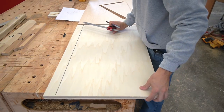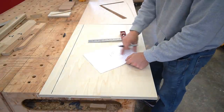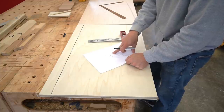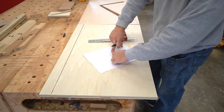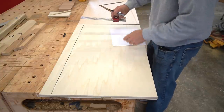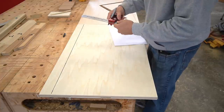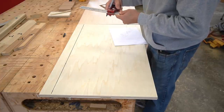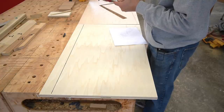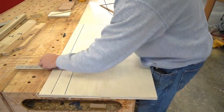Okay, so there's that two-inch line. I printed out a little piece of the drawing from SketchUp where I have this drawn up. I know from the top of my skirt board to the front edge of my nosing is going to be two and three-eighths. So I'm just going to go ahead and mark that two and three-eighths plus the two inches I just drew on there, and make another parallel line across here.